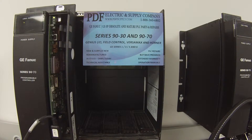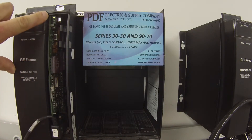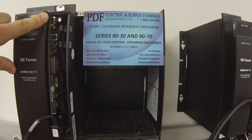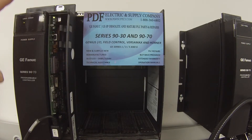The first thing I'm going to do — I've already turned the power supply on and I have an OK light. This is the top LED that is on. If this light on your processor is off, blinking, or you have some sort of a blinking pattern, then there's definitely something wrong with your processor and you won't be able to follow this test.